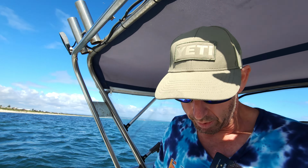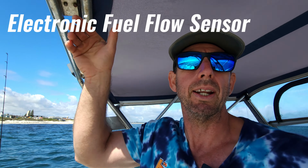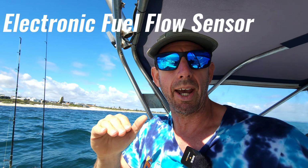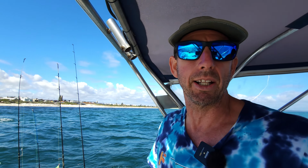And we recently just swapped to the Simrad, so we've completely gone from analog to digital. Now, the fuel gauge has never really worked 100%. So instead of changing the actual float, which is normally inside your fuel tank, all we've done is installed a fuel flow meter, which actually goes into the fuel line. And once you set your tank to maximum, which our tanks are 270 litres, once you set that up in your Simrad, every piece of information that is available to you will be available on the Simrad.